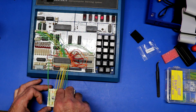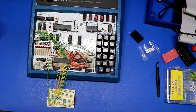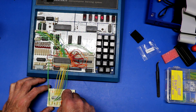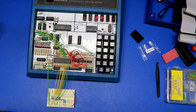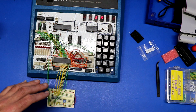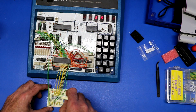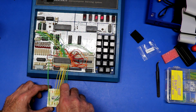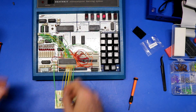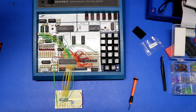We hit do-0000 to run the program. Right now it says 42. If we turn the potentiometer counterclockwise it goes all the way down to zero; clockwise it goes all the way up to 48, representing 4.8 volts. You may notice it skips some numbers — it goes 48, 45, 42, 38, etc. That's because even though this is an 8-bit A-to-D converter, they only took the top four bits and used a lookup table, keeping the program small with a 16-entry table rather than a 256-entry table. The circuit is actually providing eight bits of precision even if you can't quite see it.